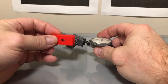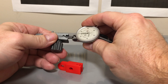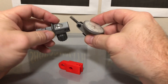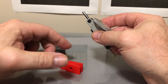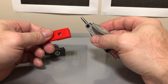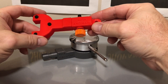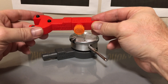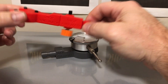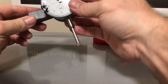We adapted it from the turn to the swivel. This guy mounts this way, it'll mount in this way here, it'll mount this way here — so it's relatively universal and you can flip it basically any way you want. The other guy won't rotate, so depending on your situation you may really need rotation. Here's a plunge indicator holder — this one will do the rotation. It'll rotate around and also tilt in any direction, so it's pretty universal, especially for a plunge indicator.